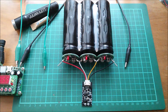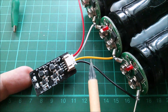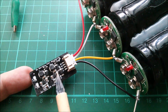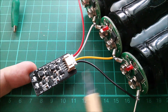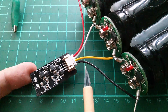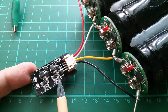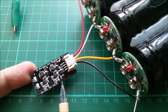Here it is - it's a JW-3S, 1.2A, meaning it can transfer 1.2 amps between adjacent cells. This is version 3.0, a 3S battery cell balancer on a matte black board with some glossy conformal coating. I haven't been able to reverse engineer the circuit yet but I want to. Being a three-cell balancer it has four wires: the most negative end, the most positive end, and the two midpoints. It only has two active transfer modules - it can transfer from one to two and two to three.